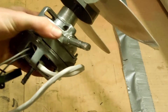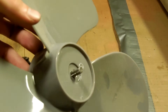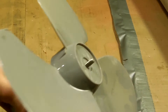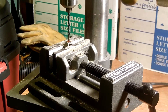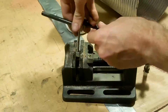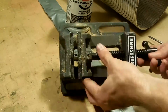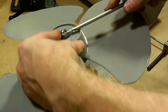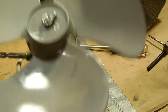The motor itself is an old salvaged fan motor that I got off of a house fan, but it has a left-hand thread nut on the front that I don't have anymore. So I need to make a set screw and a collar to hold on the fan blade. I took a little 5/16ths nut that will fit over the shaft and drilled it out on the drill press, then tapped it with a 10-32 thread. Then I cleaned it up, installed it with a 10-32 bolt, and it holds the propeller onto the fan very nicely — and that's not coming off.